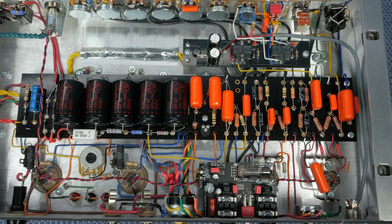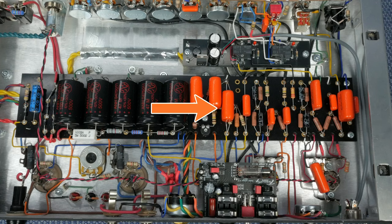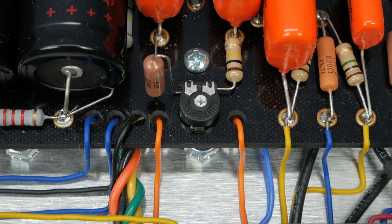There are also a few items not covered in the manual worth mentioning. Things can get tight on the eyelet board once all components are populated. There are two wires you'll want to solder on from the back of the eyelet board before placing it inside the chassis. First is the wire running from a pair of 220K resistors to the center of the bias pot. The other is the NFB wire — solder it under the 4K7 3W resistor to the 4 ohm lug of the impedance selector switch. The metal eyelets for the 5K phase inverter trim pot were missing on my eyelet board, so I soldered directly to the legs of the potentiometer. I've let Trinity know about the missing eyelets, so hopefully this won't happen in the future.